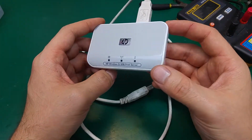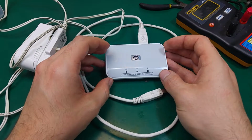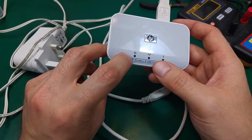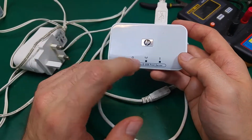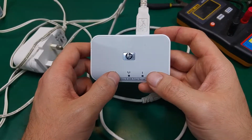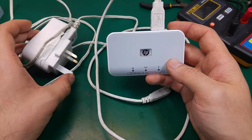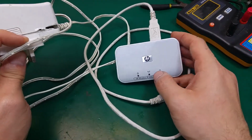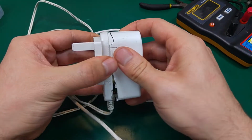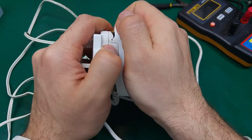And what was the problem? The problem was in the power supply and of course the electrolytic capacitors, but the random crashes were quite interesting because the power LED was at full brightness, so it must be some kind of fluctuation that was crashing the internal circuitry, but the power was looking like everything was fine. It was actually the last thing that I tried to check, and the capacitors were bad on this unit. After some time it must overload the power supply, and then it was unable to deliver the full current, and then the unit was just crashing.